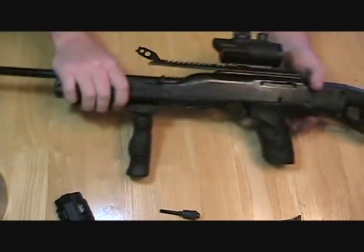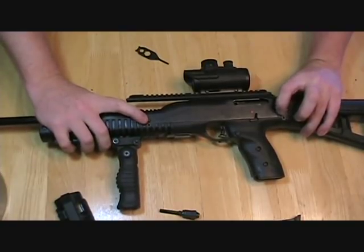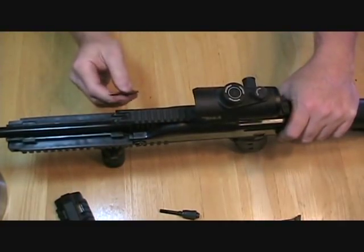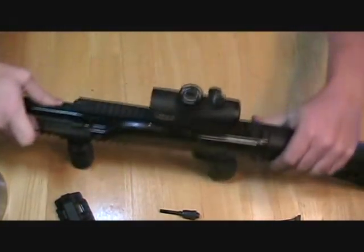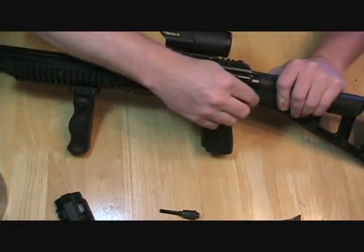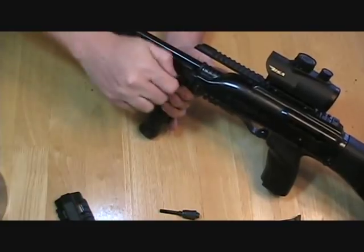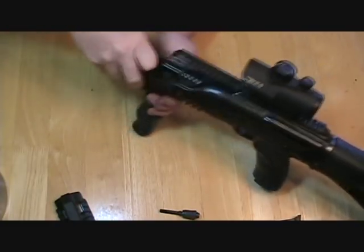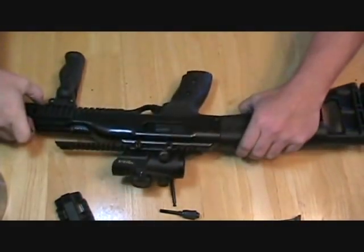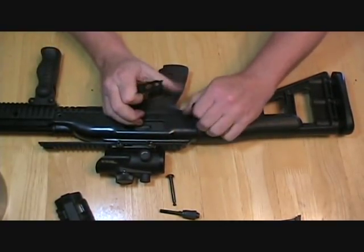Now your barrel is exposed. The next thing you're going to want to do is there are these little latches that hold the pins that hold the cover for the slide on. What you're going to do is push the back of the pins — they're little springs — with one hand, and then push the latch over with the other. Same thing with the front. Then the pins just come out. My rear one doesn't come out that easily, so I'll throw the wrench over it and use it to pry it out and it comes out no problem.